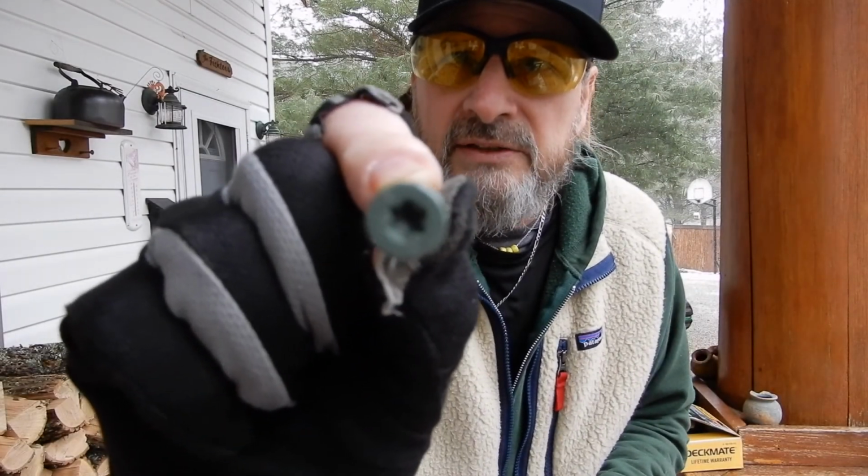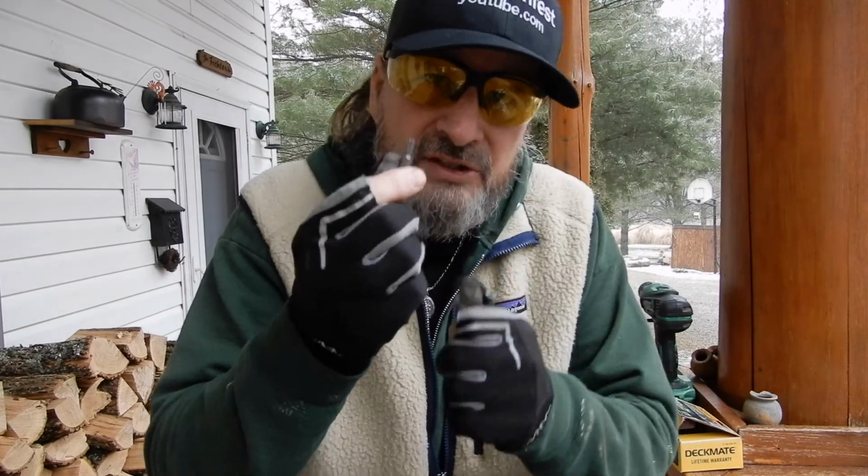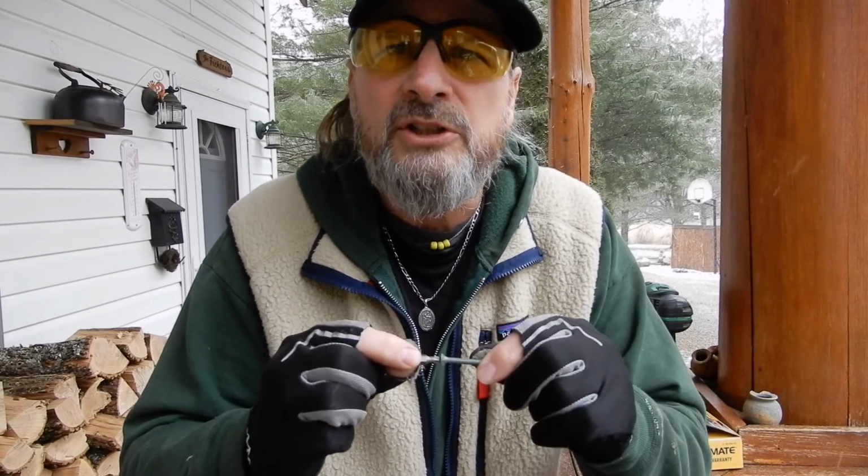Okay, one of the first things that you can do when it comes to construction is pay attention to the type of screws that you're going to use. I'll use a construction screw just like this. It has a star head on it, and it takes a star bit like that. Now this has kind of replaced the Phillips bit. We've seen a straight blade screwdriver and a Phillips screwdriver, but the star bits have kind of taken the place of the Phillips screwdriver bit. Because the thing is, this bit holds inside this screw so much better.